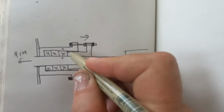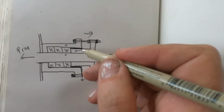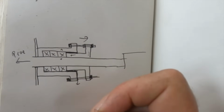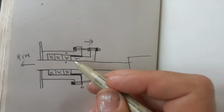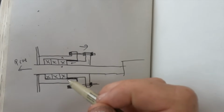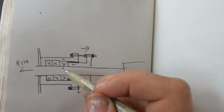What I've got is corrosion where this gland follower goes in, meaning it's practically kind of welded itself in. As it rusts, it expands into a contained space. So our option may be just to literally cut it all off, or maybe put just some cuts in this to free up the pressure and get it out. We'll see. But that's how they work. By pushing this way, you're squishing this packing and expanding it, sort of, at 90 degrees.